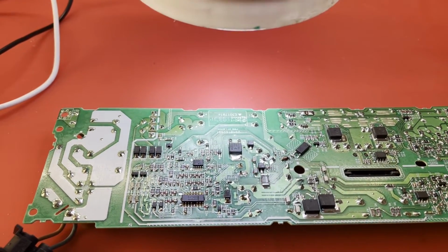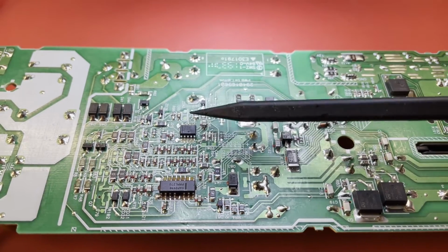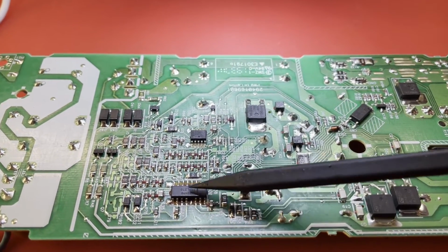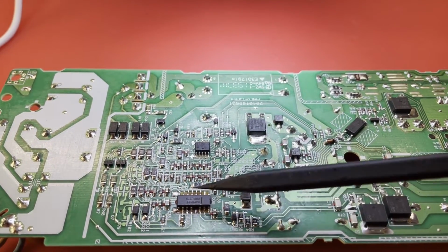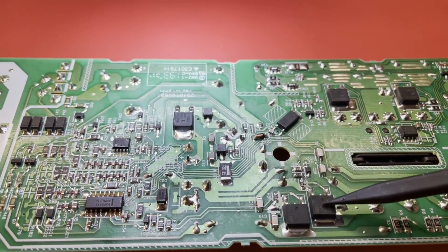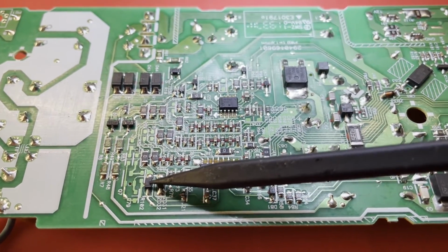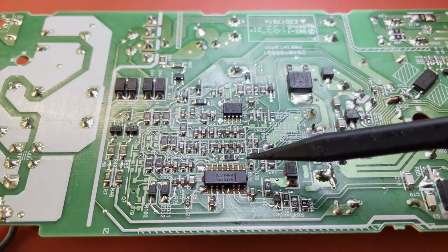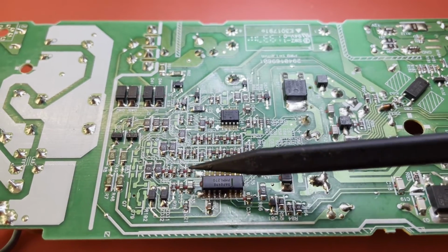All right, I've been doing some more digging. And of course, this is the area we were working in earlier, the power factor correction circuit. And now it looks like this IC here is also shorted. This is the DAP049. This is really the IC that drives the MOSFETs for the 12 volt generation. So this IC is connected to these MOSFETs way down here, which may or may not be shorted, one of them. But the Zeners right over here are also connected to this. These two, the label J3, I believe these are 18 volt Zeners. I've got some of those, I know, but yeah, we've got some other damage here, but I believe this IC here is shorted. I do have these on hand, and I have these Zeners.